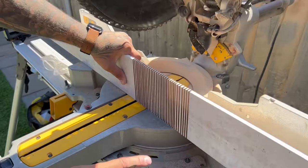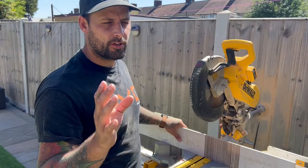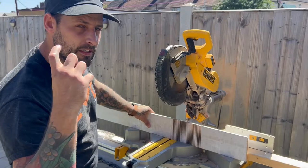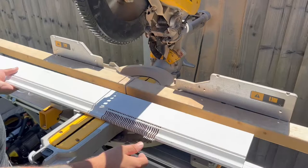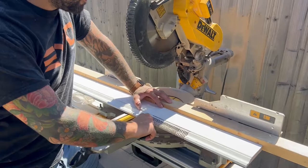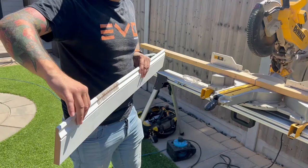After all of your cuts, this is what you should end up with — something that looks a little bit like this. It's a little bit delicate so be careful with it. How far you need to cut along is dependent on the curve: if it's a long sweeping curve you want to extend it through; if it's a really tight turn you want to keep the cuts super close to allow it to bend tight. You can't get away from the fact that you're going to have cuts visible on the face — there's no other way around that, because you need to cut the full depth.